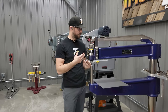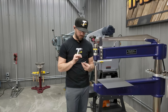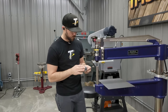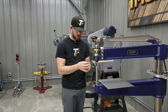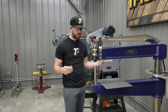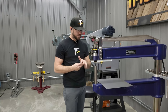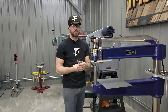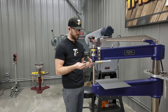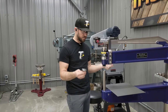Clay Cook, when he designed this as an updated machine, really did a great job with the tooling selection. I really love these larger lower dies because especially when you're working on a door skin panel, these larger lower radius dies do a great job of handling a bigger part and helping the stability of the machine.